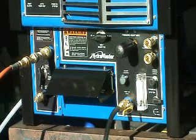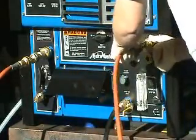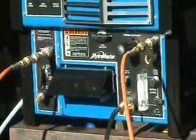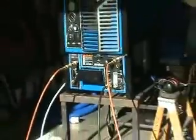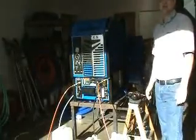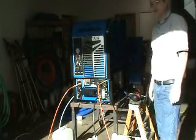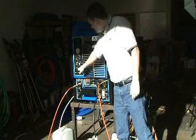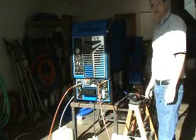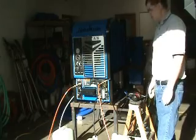And then we'll connect the other end of the solution hose to one of the outgoing high pressure solution ports on the front of the machine. That way, when we pour the antifreeze into the water box, it will flow out of the machine through this hose and back into the other side of the machine. Once we do that, we're going to allow that antifreeze solution, with the pump in the no heat position, to circulate throughout the machine for 2 to 3 minutes. This will ensure that the antifreeze solution gets distributed throughout the entire solution path of the machine.